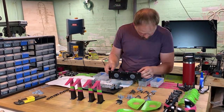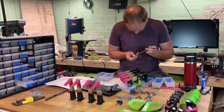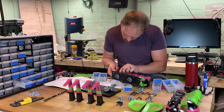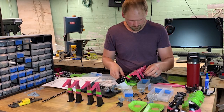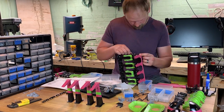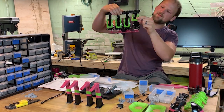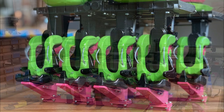Then you assemble the wheel bogies — put the little bearings on, the bogies on, put the drip trays on, and then the top portion of the wheel bearing assembly. Once through that, you put the wheel covers on and you're pretty much done. It took me about three hours to assemble one car, and the second car took about one hour — so there is a learning curve.